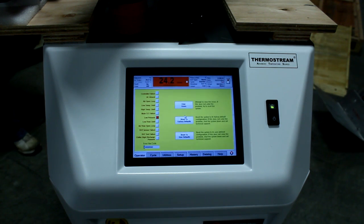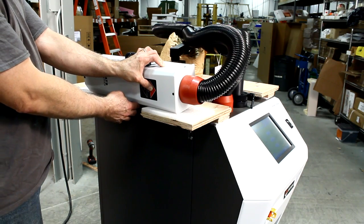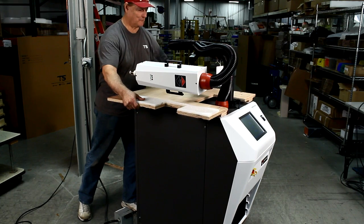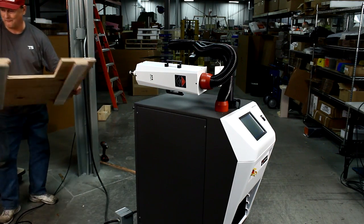We do not need compressed air to be connected to the machine for unpacking. At the thermal head, press the red stand button to raise the stand and head off of the packing board. Gently lift and remove the packing board. Take care not to scratch the system.